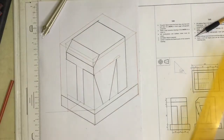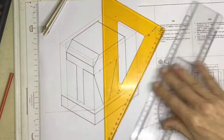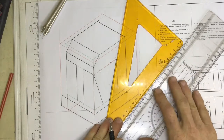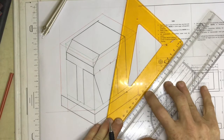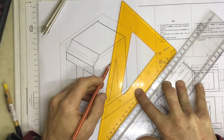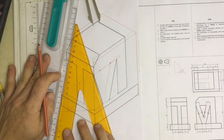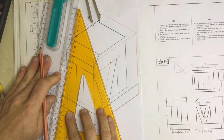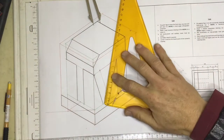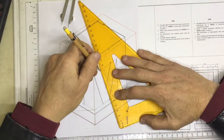How do you draw parallel lines in an isometric drawing? It's pretty easy. You take your ruler, line it up, take your set square, line it up on the line you want. Take your T-square off, and you can slide down drawing a construction line. Swing it around, get your set square lined up on that line, slide it across, and you can draw a line from there to there. You've just drawn the non-isometric lines at the correct angles, and you can draw that in very easily.